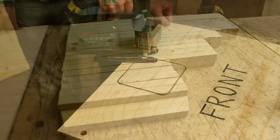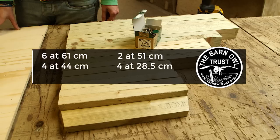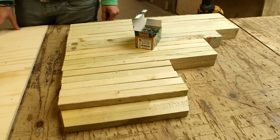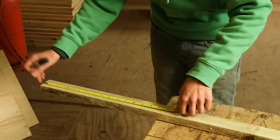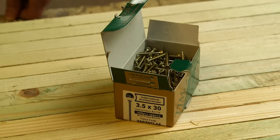The battens you'll need are: six pieces 61 centimeters long, two pieces 51 centimeters, four pieces 44 centimeters long, four pieces 28.5 centimeters long, and another two pieces 28.5 centimeters long — but these have the ends cut at an angle of approximately 15 degrees. All the dimensions you need are on our website.